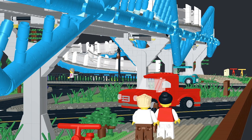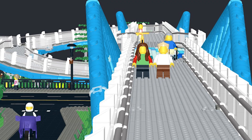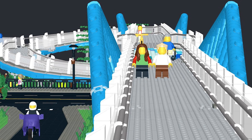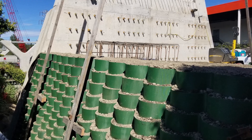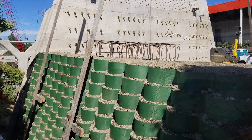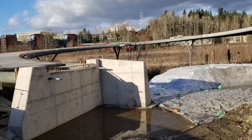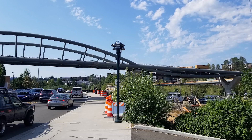The scale — we tried to represent scale as best we could, but there are some liberties we had to take just to make the LEGO work with what's really there. Because it's a loop ramp, it kind of curves around there, and that actually gives it a geometric strength. So if you're out there you'll see a big concrete wall, and the bridge is actually directly tied into that, kind of anchored into it. That helps take a lot of the lateral or horizontal forces so that the piers — those steel piers — mostly just have to take vertical forces.